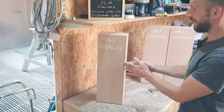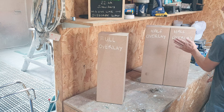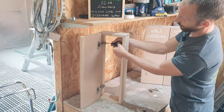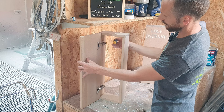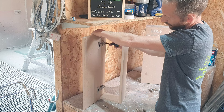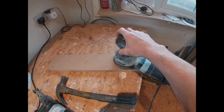The last adjustment is backwards and forwards - best shown on a half overlay where two doors share one division and one door might be protruding more than the other. To get those doors flush, you bring the bar of the hinge backwards and forwards by releasing the back grub screw - on most it's a slotted hole. Tap the hinge forward or hold the door and pull. Check the screw position against the hole before you release it so you know how much you've moved it. Once you close the door, it will be adjusted forwards or backwards to sit flush.